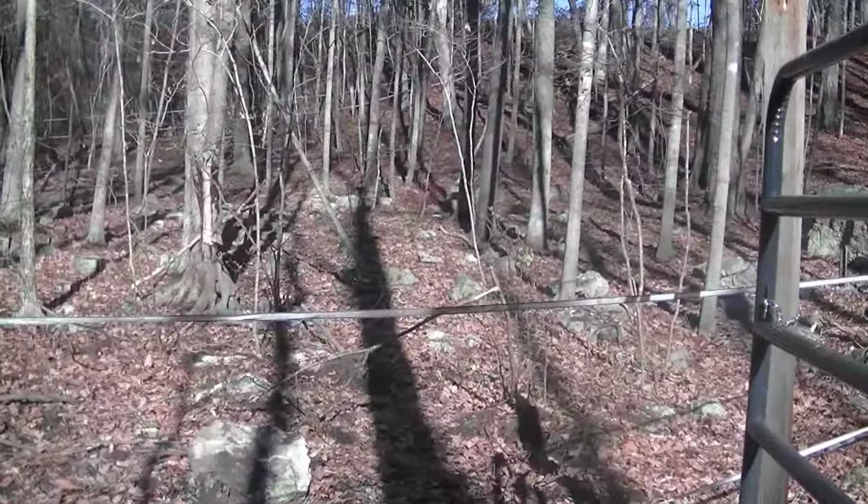What's nice about these is that you can just untwist right here and move the whole blade around to get whatever angle you want. And you do want those really nice 45 degree angles so that the trim matches up nicely in the corners and you have nice smooth seams.